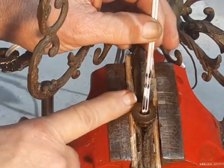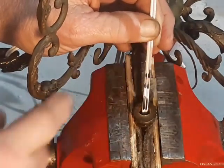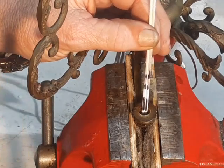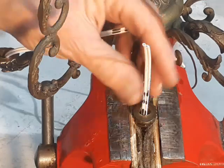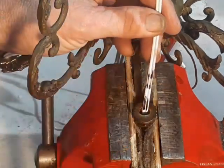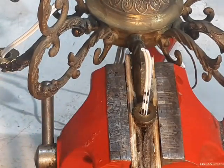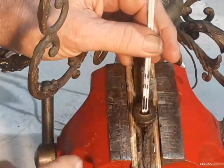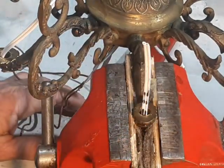This is the last arm to be wired. You'll notice these marks — one wide mark, two narrow marks — that stands for seven feet. I've wired six arms on this chandelier, and the arms are only about four inches long, yet it's taken seven feet of wire. Very deceptive how much wire a chandelier actually consumes. There will be a little bit of scrap, but it still comes out a little more than 12 inches per arm. One good rule to remember: nobody ever saved time or money by cutting a wire short.